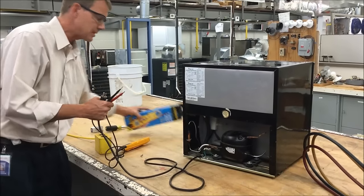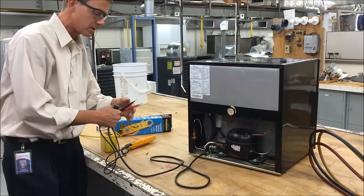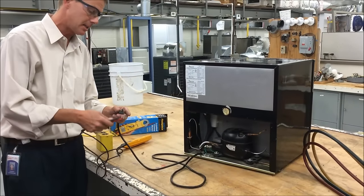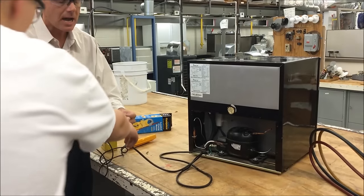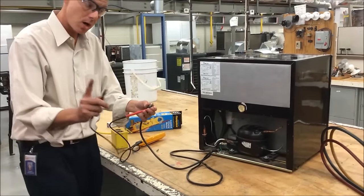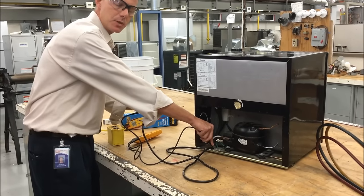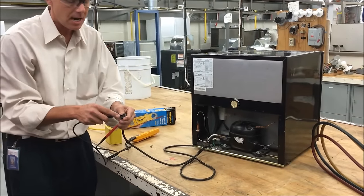For level two, I got you some new meters to use this year. I'm going to use this one right now, but I'm also going to show you the other one because that's the meter you'll be using in the contest and throughout the year. Which one's going to be ground? The one on the bottom — the round one. So I'm going to clip this to ground. I'm going to make sure we've got a ground — there's the green wire. We should have a beep, we should have continuity. But I should not have continuity if I touched either side here.